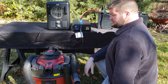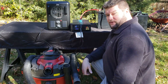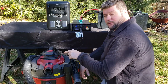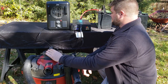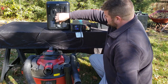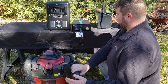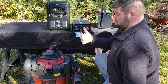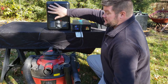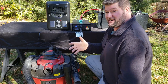Different combinations might give it a higher surge, so first we'll try the wet-dry vac and then turn on the heater, and then we'll try it vice versa — because once it's already pulling 1,500 watts and we kick on the other appliance, that's going to give it a really big surge and we'll see if it can handle that kind of abuse. Everything is plugged in — we start with the wet-dry vac and then turn on the heater to see how it works.